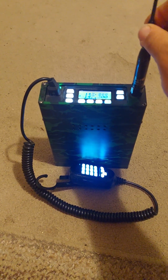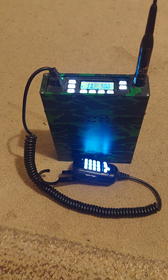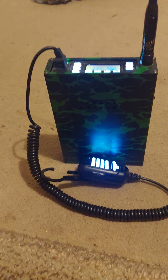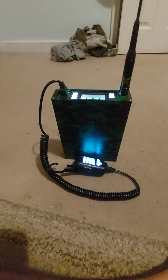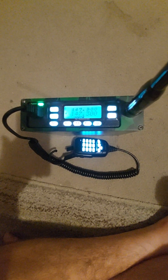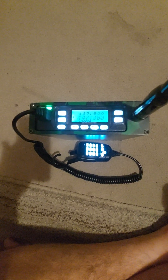Down there where you bent it, between the two pins, right at the halfway point all the way down that hairpin — that's the point, even if you've got a metal boom, it's actually recommended to secure that thing to the boom at that point. The advantage is it won't affect the tuning whatsoever, because it can't. That's electrically zero right there. Both sides have to be equal distance — that's zero. But the beauty is, now you're DC grounded for both sides of the antenna. That's always a good thing.